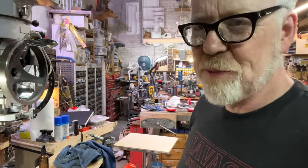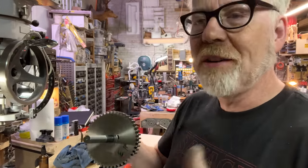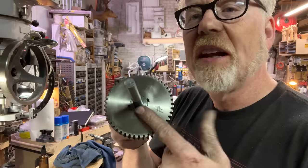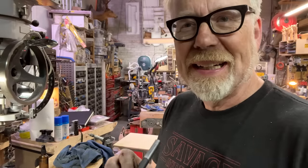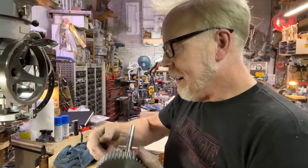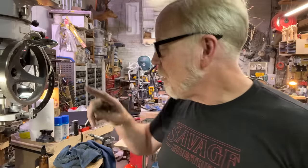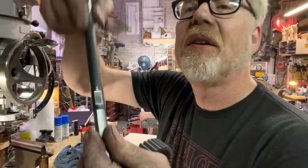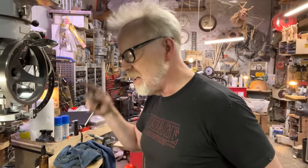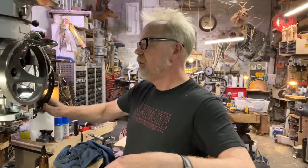This is a mechanical arrangement of bearings and shafts. And when you want to lock a gear like this to a shaft, the best way to do it is to key it. That is to carve a slot in here, have a slot in here, and have a key that marries the two of them. And that may be how I eventually do this, but right now I am going to use set screws. So I've milled a flat here, and that should be plenty for the amount of torque that this engenders.